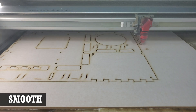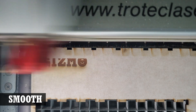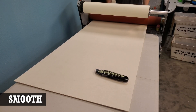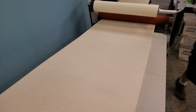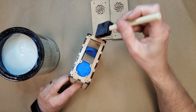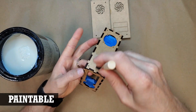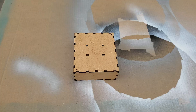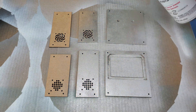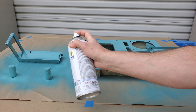Again, because it's engineered, MDF has a perfectly smooth surface. This makes it great for applications where you want to apply a paper mask to keep the surface clean for post-laser printing or painting, or for paint filling after engraving. MDF is very paintable. However, even though it has a super smooth surface compared to other woods, it does require that it be prepped with some kind of sealer before painting to get the best finish. Unlike other unfinished woods, you won't get that paint bleed under a paper mask when paint filling or spray painting engraved areas.